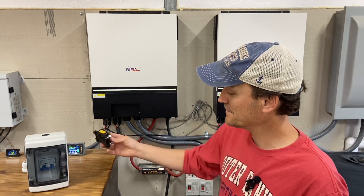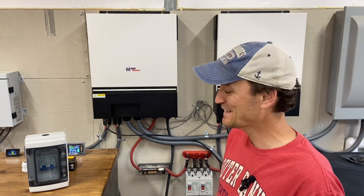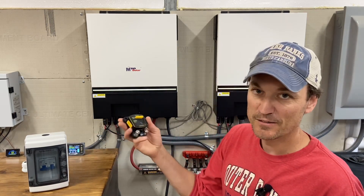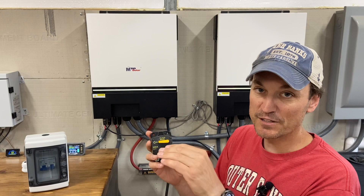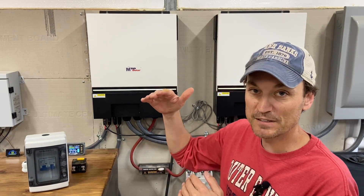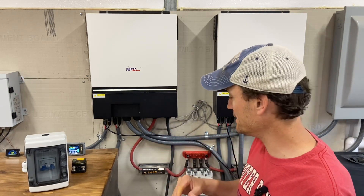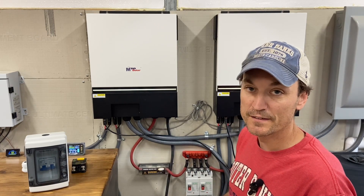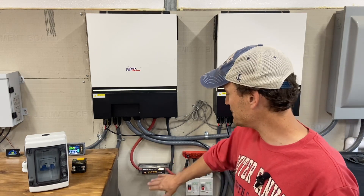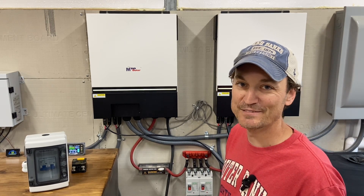So yeah, brief video — that should have been an easy one to make but I just kept trying to switch things around to make it shorter. That's it. For Blue Sea or another quality type: for 24 volt or 12 volt systems they're fine, but anything above that find something with a max voltage ceiling at 60 volts or above — that way you've got a little padding. Get the correct amperage for your system and you'll be good to go. I can talk about T-class fuses and the need for those in another video, but anyway guys, thanks for watching. A lot of stuff coming up soon. Thanks.